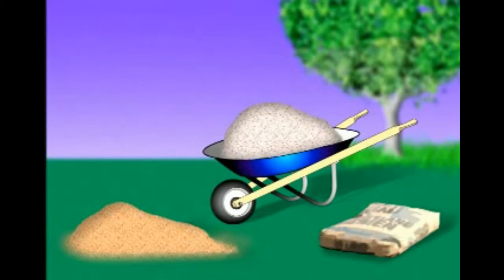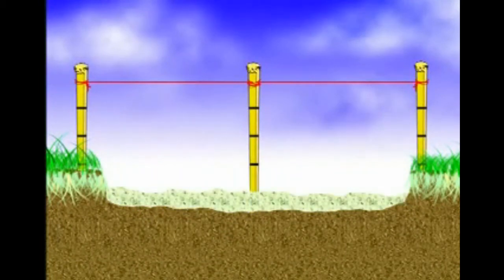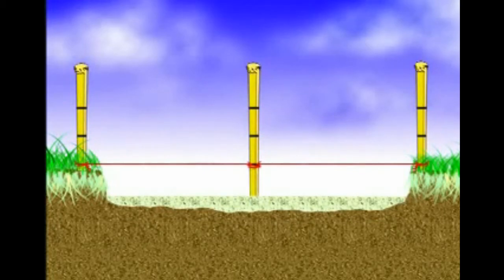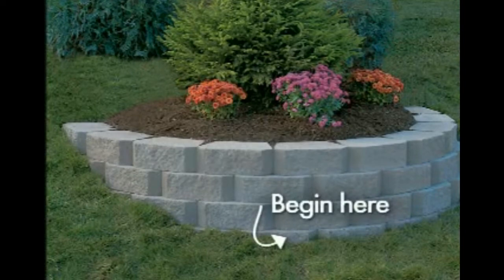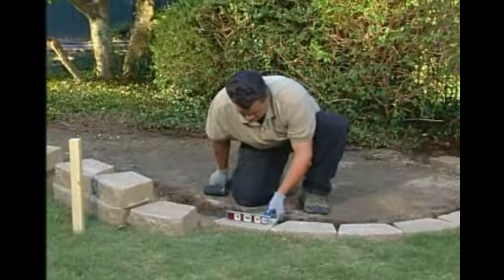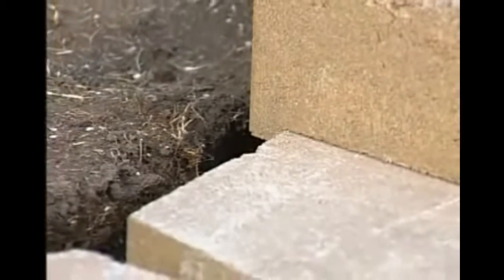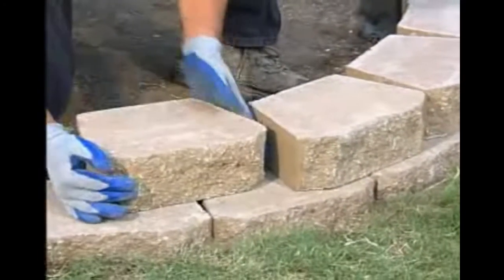Be sure to keep this mixture dry, as it will set if it gets wet. Fill the length of the trench to a depth of four inches, use a two-by-four to smooth out the base material, and make sure it is level in both directions. Readjust the string height on your stakes to the top of your first wall level. If your wall is set on ground that rises or slopes, begin at the lowest point. Set the stones in the base side by side, leveling each stone in both directions with a torpedo level. Set the next course in a staggered pattern, making sure each stone bridges the two stones below it so joints do not line up.